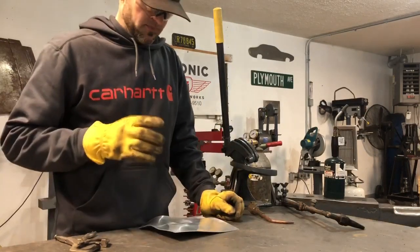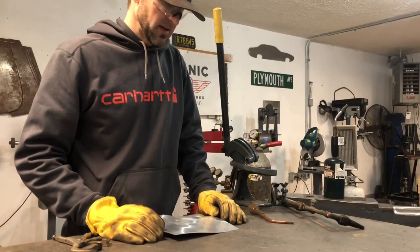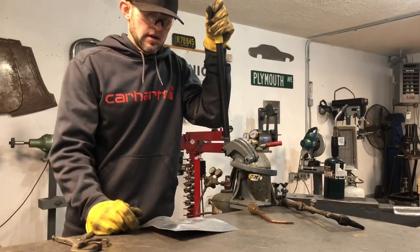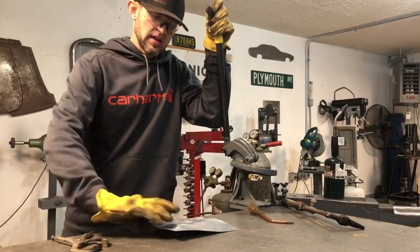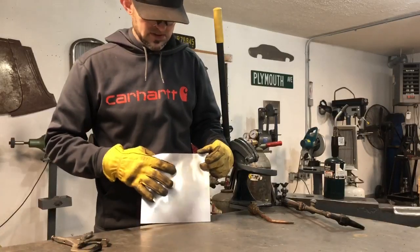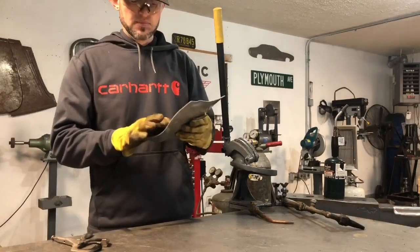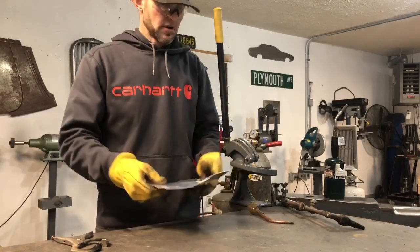There are a lot of people out there who think that the black soot alone is what makes the material soft — that's absolutely wrong. This is the only way to do it: use the torch, apply the black soot, then burn the black soot back off. You almost take it to the point of melting. I got it a little warm in a couple areas. If it's a bigger panel I'd start with like a 14x14 or something. It's okay to have a little distortion because you can work that out in the English wheel.